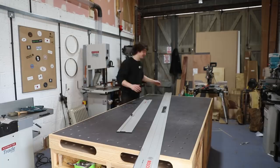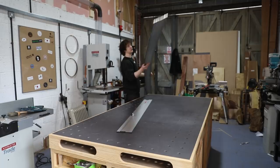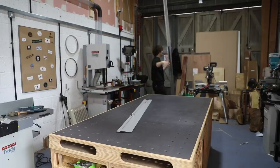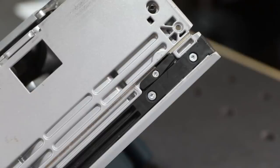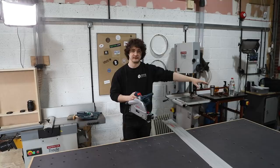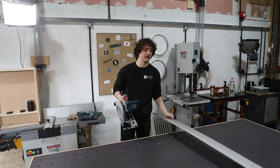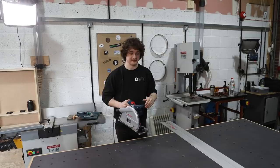The flexibility shouldn't really be seen as a negative. The only nightmare it brings is trying to get it up against the wall because it's just sort of flopping all over the place. However, if you'd prefer a more rigid guide rail, you can take out that little black strip and this saw can then be interchanged with the Festool and the Makita and other guide rails should you wish. This also has the added benefit that if you're working on site and a colleague has a Festool TS55 with guide rails, you can use their rails with your Bosch plunge saw — whereas the reverse wouldn't work.